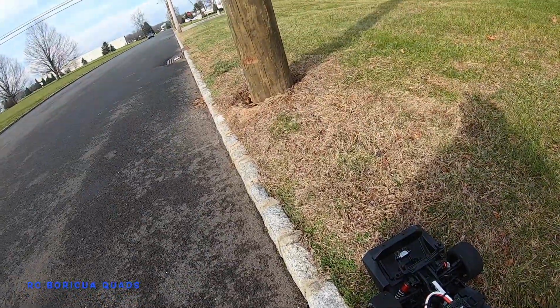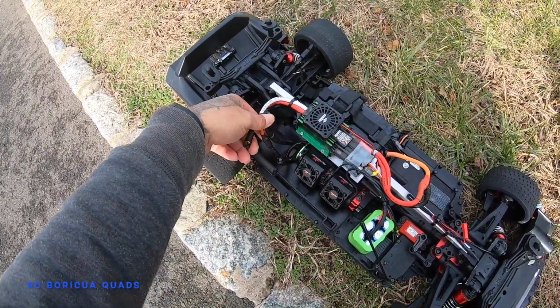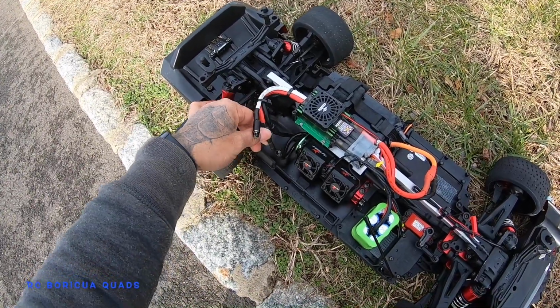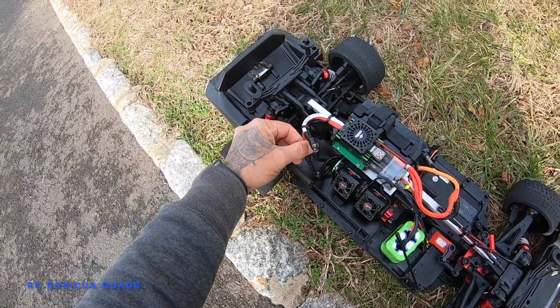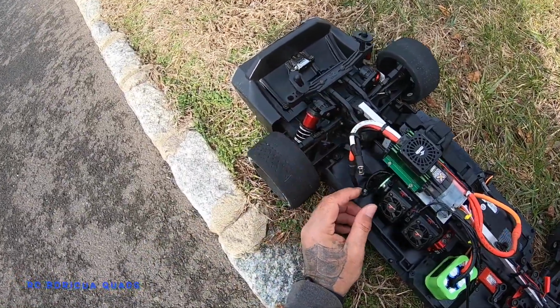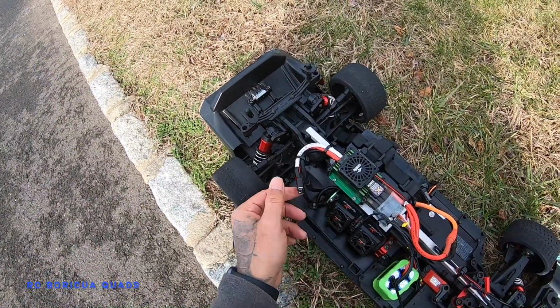So that's what really happened, guys. That's why it was cogging. It's just a white wire. Black looks good. Yeah, black one looks good, the red one looks good. It was just the white one. You see the solder came out. And the reason for the soldering to come out is because it overheats.